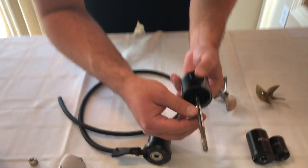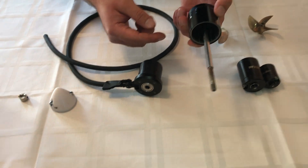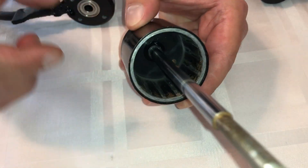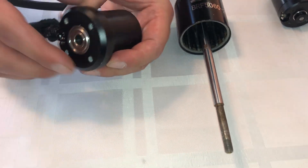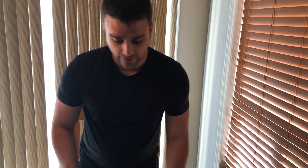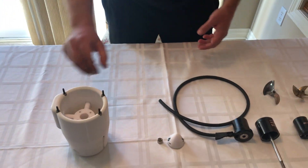I'd like to show you the internal components of these motors. I've had a custom shaft machined for this project, which I use to replace the existing shaft. You can see inside that the magnets are coated, the stator is coated — it comes coated. The bearings are pretty heavy duty, so you don't necessarily need special thruster bearings; these ones are fine. If you'd like to replace them with ceramic bearings for salt water use, you can pop them out and put new ones in, though I wouldn't bother — I think just rinsing it in fresh water afterward would be fine.